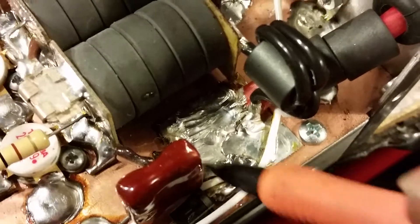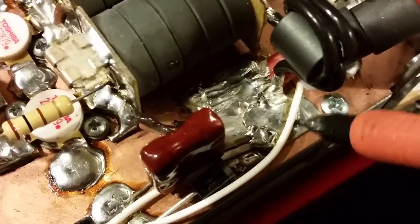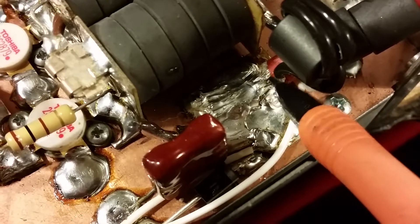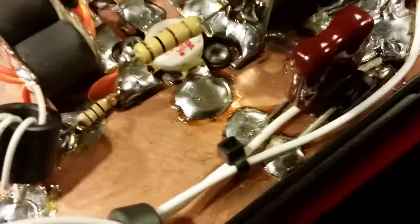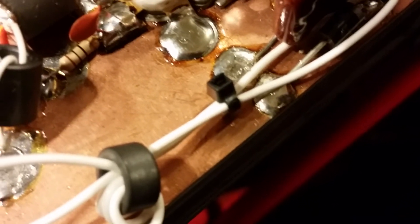This hot bus was really in need of a good hot iron. I just hit it with a good hot iron and kind of smoothed the solder equally around. The power wire in this one is good power wire. I hit that ground over there too, just to make sure — it kind of came up like that, so I made it flat and soldered the whole thing equally. I used two different types of solder on there and the flux got it kind of nasty, but I cleaned up a little bit.